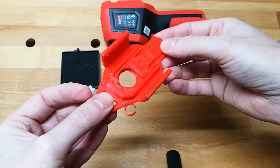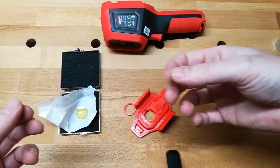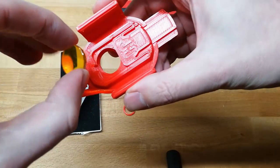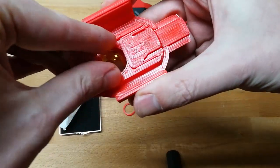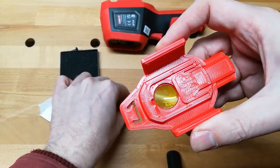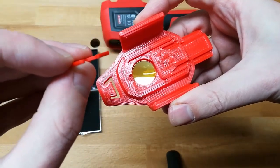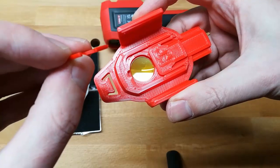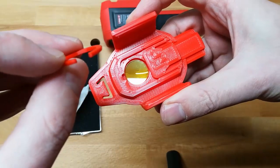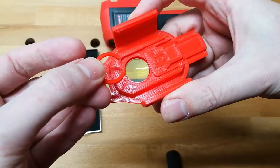To mount the lens, make sure that your hands are clean — no oil or anything. You take the lens and carefully place it in the hole. Then you take the C-clip — or circlip, whatever it's called — and you look at the draft angle of it. Basically, the wide flat side should be downwards against the lens, and that makes sure it applies a constant force holding it in place.